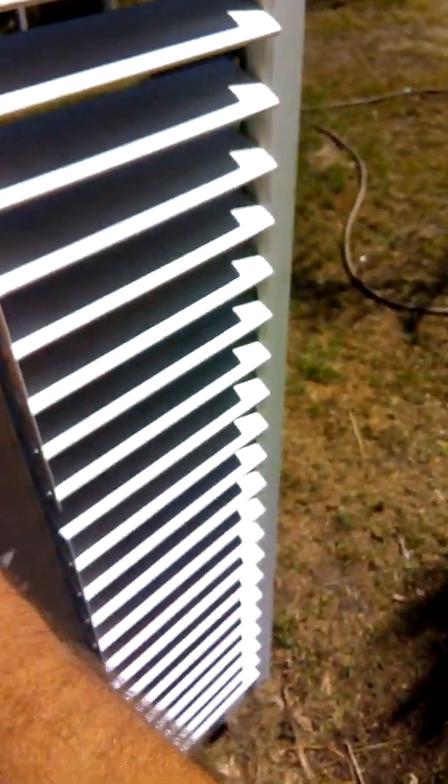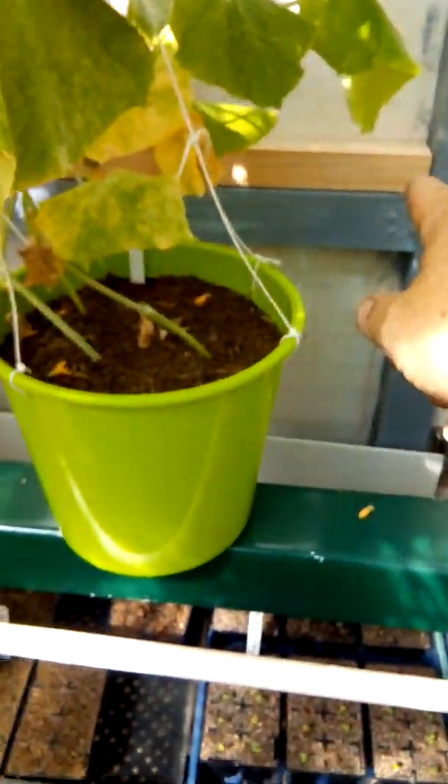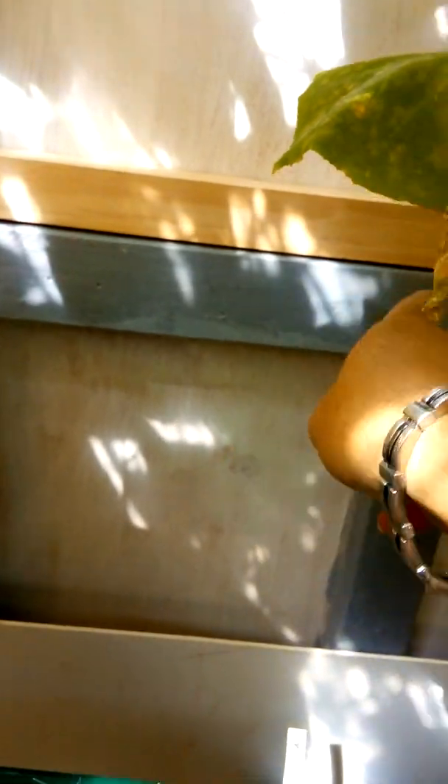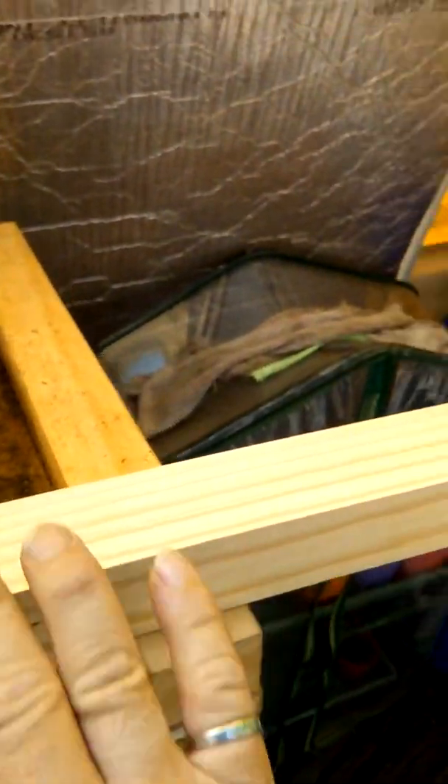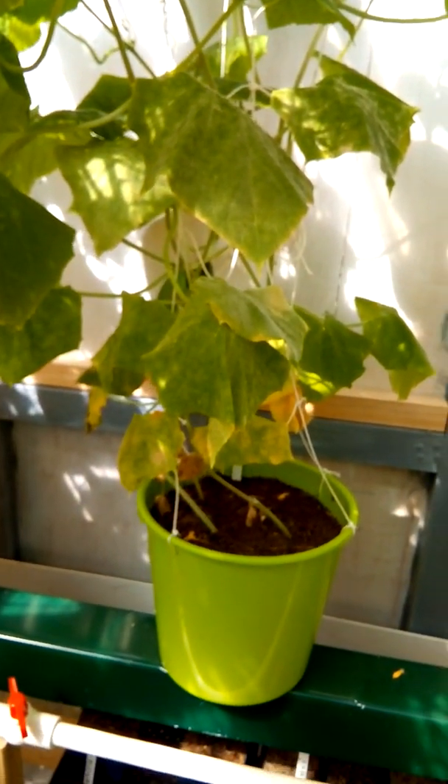I've left my doors open so the breeze blows through. Now back here, I'm going to be building a window. That's my bottom piece — I'll use nails to give it a couple of inches off the bottom. So when I open up the window, this is the top piece here. I've got to do my sides, cut that piece out at the back, and screw that to the beams. I'll put a little handle on the bottom so I can shut and push it out, with some hinges on the top. Then it'll be nice and cooler when it's so hot in here.